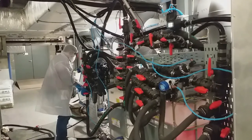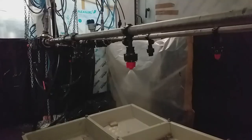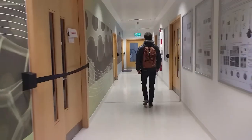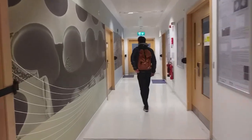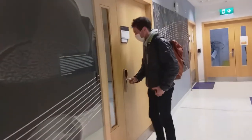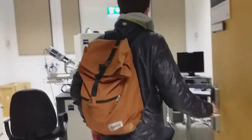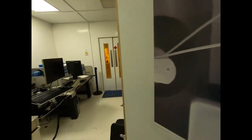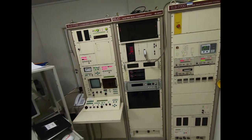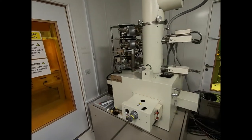At another frontier, on the top floor of CRAN, we have designed and built a test bed for the effects of magnetic fields on water spray. It is often necessary to structure blanket films into micro- or nano-sized objects. We routinely use standard UV lithography techniques and dry etching to achieve this, as well as electron beam lithography. Through the facilities at the Advanced Microscopy Laboratory, we have access to the required equipment, in particular the two e-beam lithography tools from Zeiss and Elionix.